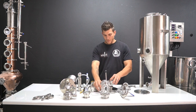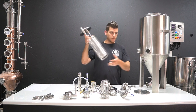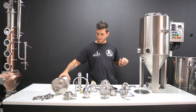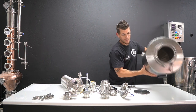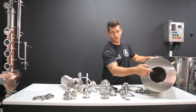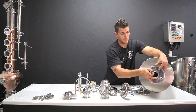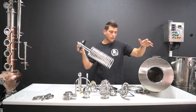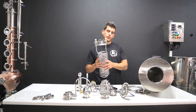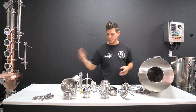We've also got an upgradeable chilling coil - a 7.5-meter chilling coil specifically designed for this fermenter. It fits through the six-inch hole on top of the fermenter; the coil is five inches so it fits through. You are then able to run either chilled water, glycol, or whatever system is available to you through the coil, with an STC 1000 or PID controller through the thermal well, to bring the temperatures down in those summer months or if you want to cold crash in your fermenter.